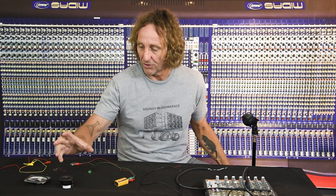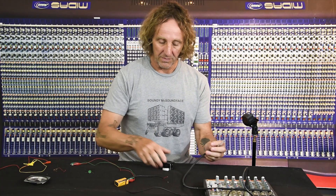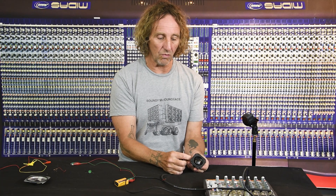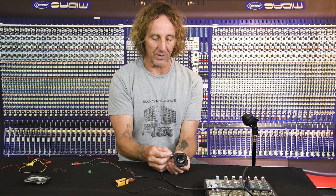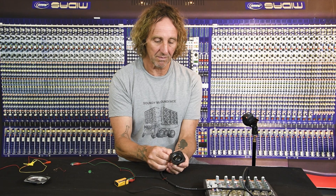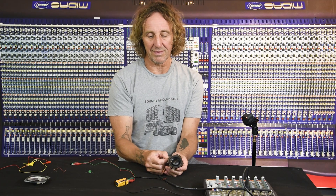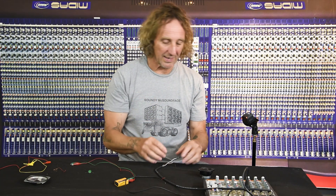Let's put phantom power onto a small speaker and see what it sounds like — a real-world test of how much work it performs. Hooking up phantom power to the speaker: it pops, but then goes away. It has one good surge with a lot to give for a second, and then nothing. So 48-volt phantom power puts out a bunch initially but has no follow-up.